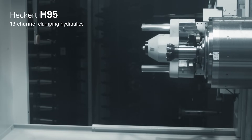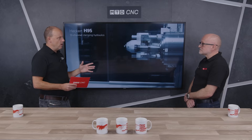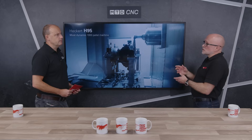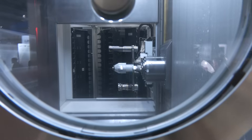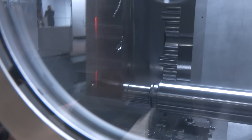This spindle technology — you offer various spindles: HSK 63, HSK 100, 30,000 RPM and all of those things. One of the things I'm particularly interested in is the quill feature, which is quite unique for a machine of this size. The quill is sometimes called a traversing spindle — it's an extendable spindle. Normally, if you want to reach inside a job, you'll have very long cutting tools, which means less rigidity, very expensive tools, chatter and vibration. So by having a very stiff quill that goes deep inside the job, you can use very short tools and get very high performance productivity. It's unusual to see a quill on a machine of this size — you usually see them on larger boring mill type machines — so there's a big advantage here.